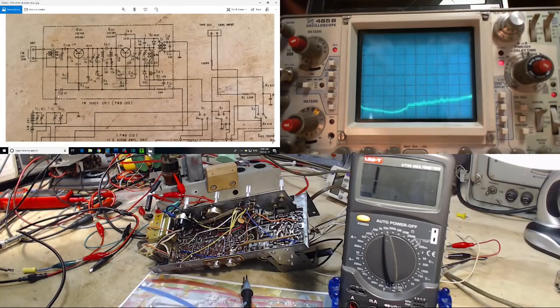The chassis is hooked up here. So this is all chassis voltage through here. So instead of 2.4, I'm getting a hard 0 here. So that really implicates this capacitor, but I'm reading 7,000 ohms from here to here. So if this capacitor is good, and if this capacitor is good, then only in this capacitor. Ooh, I never looked at this one. 0 here. So, if this were shorted, you'd be getting, I am measuring. Oh, this comes down through here. I thought it was connected there. It's not.